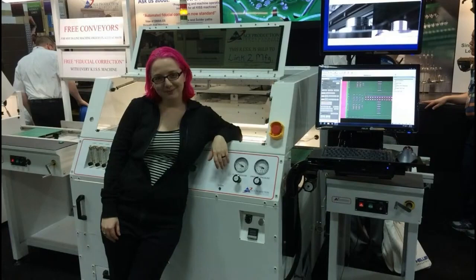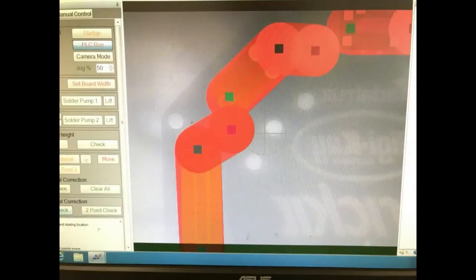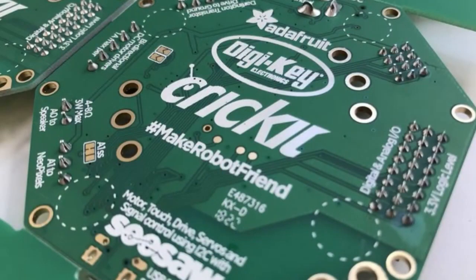The problem is you need a selective solder machine to really solder these in, or wave soldering, or do it manually — because it's not an SMT process. We even had a series of posts about what you have to do. They don't go through a surface mount pick-and-place machine. You have your board surface mounted, then you take it out and manually place the connectors, and then use a selective or wave solder machine. If you have a lot of them it's not a big deal, but if you only have one or two terminal blocks, it's a pain to put a small inexpensive board through a second selective solder process just for one terminal block.